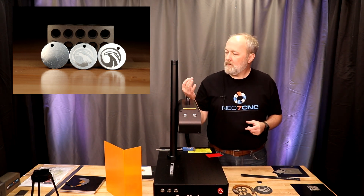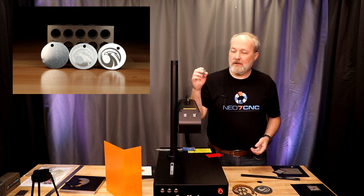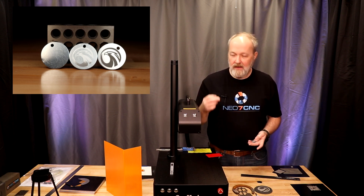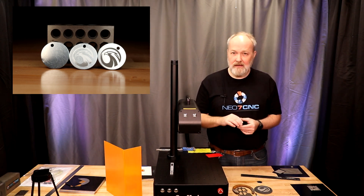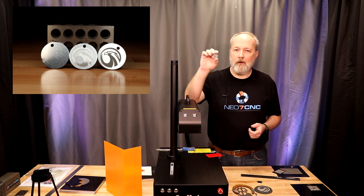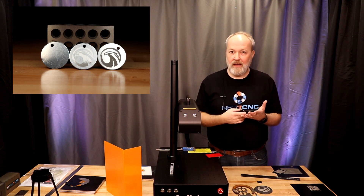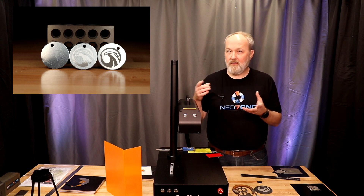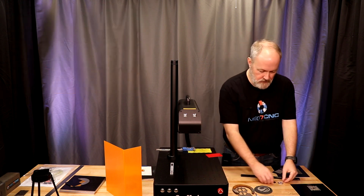On the second try with the same tag and same image, using fill mode it was looking good — leaving a light silver mark — but then it went a bit AWOL at the bottom. I think touching the material with my fingers may have messed it up. Then I changed the pulse width and got this awesome dark gray result that turned out perfect. It's just trial and error, but playing with all the different settings this machine affords — frequency, pulse width, and 60 watts of power — there's a lot to tweak to get fantastic results.